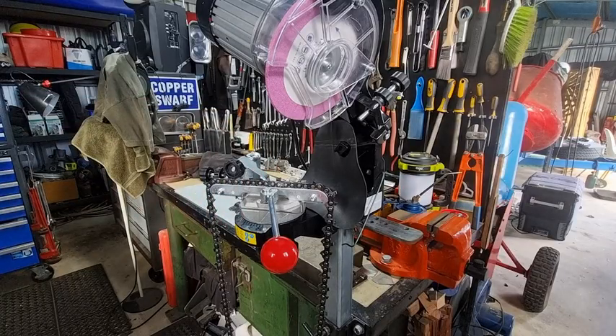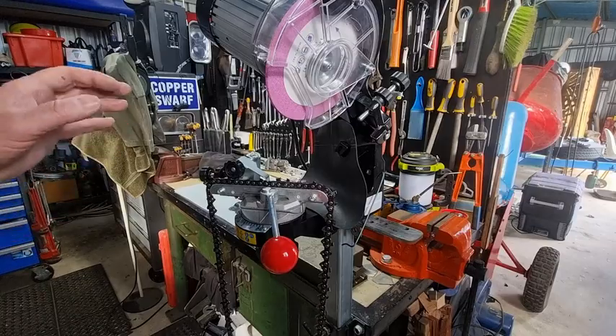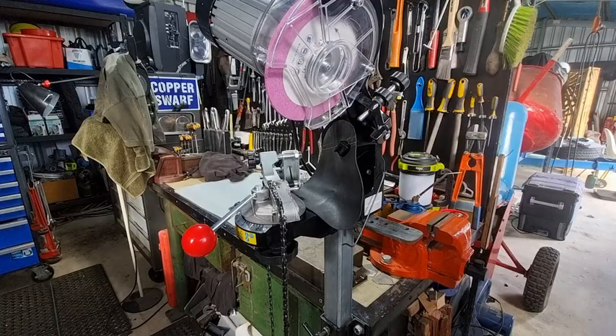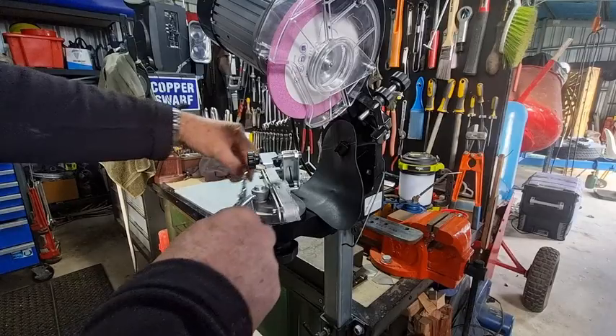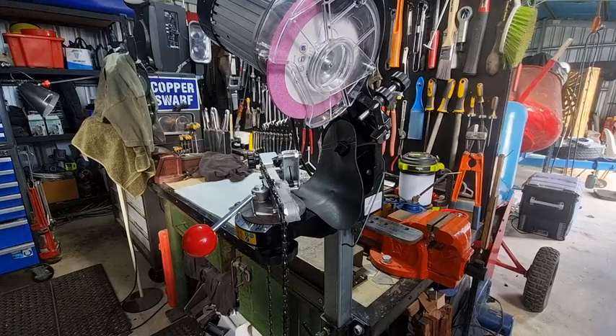Now, when you finish, this is where the mistake can happen. A lot of people don't check for the average size tooth — they might start with the shortest tooth or the longest tooth. What they actually do, and I've seen it happen quite a lot, is when they finish doing one side they'll move to the other side and start grinding without even checking. When you go to the other side, you've got to do exactly the same thing: take the chain off, go through, pick out the average length tooth — which should be very similar to the other side — mark it with a red texta, and mark teeth that are too short or too long with a black texta during your sharpening process. When you're finished, then you can adjust for teeth that were either too long or too short.